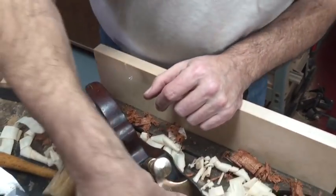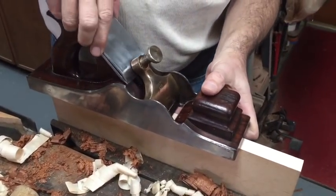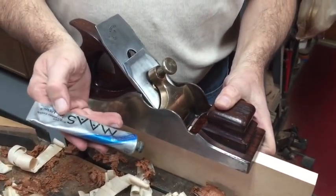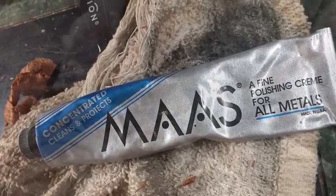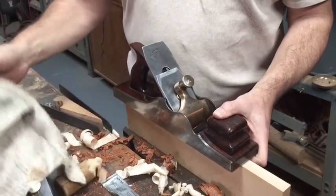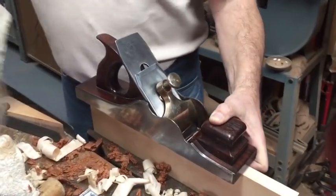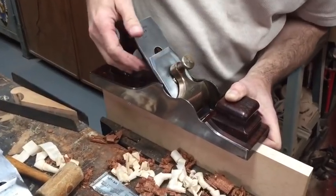On the bronze, I used a simple metal polish — MAAS polish — which I've used on cars and things like that. It's a fine polishing cream that works great on stainless steel, bronze, brass, and most metals. You just take a tiny little bit, apply it with a small rag, let it haze over, and then take a secondary rag and give it a little buffing. You can see how beautiful it comes out.